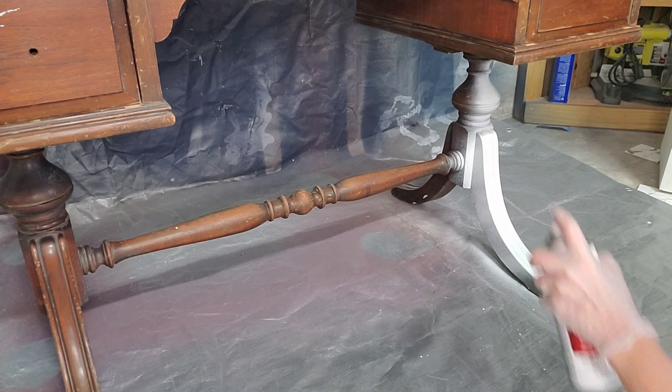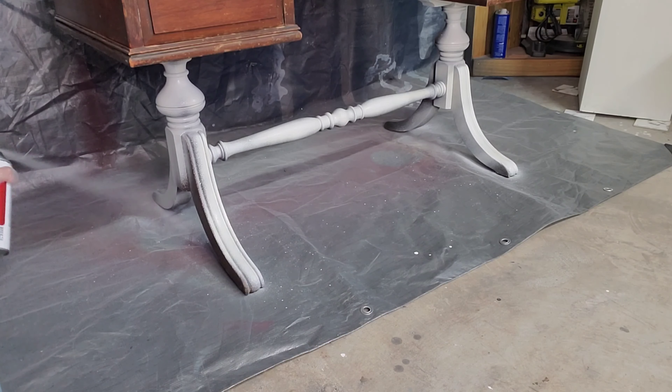Moving on to number two — why do we need to prime to begin with? Primer is used to cover numerous amounts of stains, but it's also used for a variety of other things. Priming will even out the surface that you're going to be painting, which is beneficial for getting that really smooth finish that a lot of people try to achieve. It also prevents the peeling, the cracking, and the fading. Studies have shown that pieces painted with primer had color that lasted longer and was more vibrant — not as dull as the one without primer.